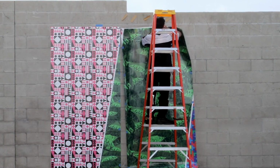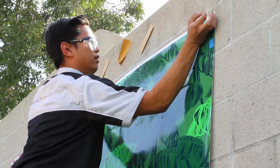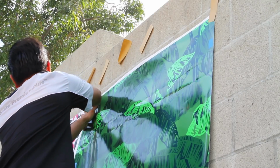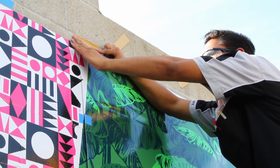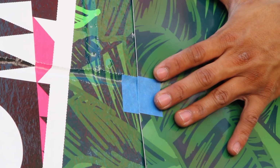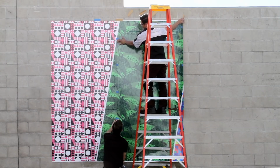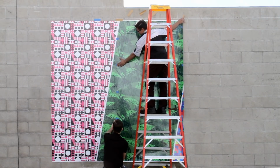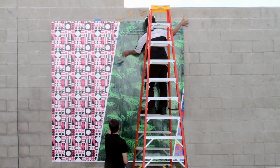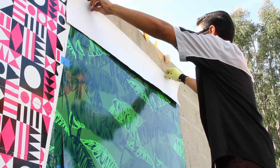Once the first tile is installed, anchor the next tile on the top 2 corners with masking tape. With the panel hanging loose, use the registration marks made of blue masking tape to properly align the 2 tiles. Have somebody help you check the alignment of the remaining blue tape and adjust when necessary. Once the alignment is set, apply using the same method as the first tile.